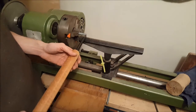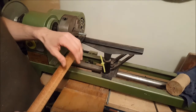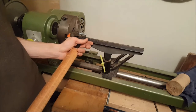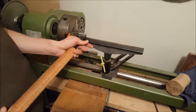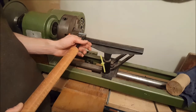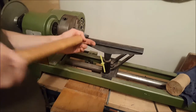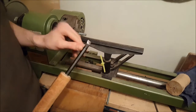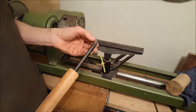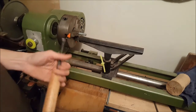When I got to a very thin diameter, the height and position were perfect for turning, but at a certain point the angle needed to bite into the material was too close to the angle of the tool going under it. A few times the tool would just go under it — I managed to pull it off, but I made notches on the holding part, so you've got to be careful not to get caught.